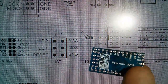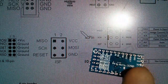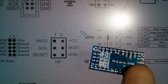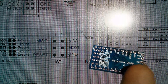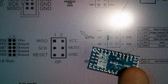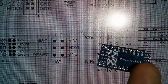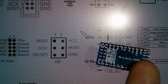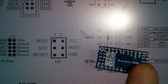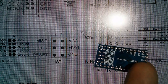Let's do a quick check between some searched ISP header graphics on my computer monitor and the unit itself. VCC and MISO are at the top on the reference graphic. You can see on the Pro Mini they're actually the other way around - VCC top left, MISO top right. But that's because this thing is meant to be accessed from the top, but I wanted to see the silkscreen on the bottom. S-Clock and MOSI are the middle two, and Ground and Reset are the bottom two - they certainly tie up with the ISP header, albeit they're the wrong way around left to right.